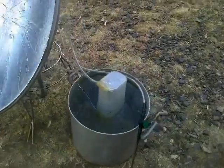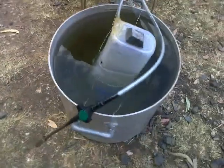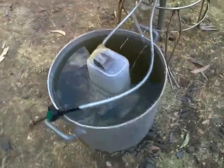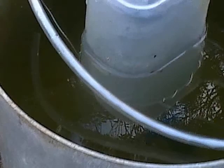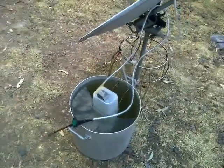I've been running this thing pretty much all day. As far as I can see, I've got 1.75 litres of gas in the gasometer at the moment. But if I add this chunk of a quarter of a pound of lead — and I'm really careful — perfectly centred, there it seems to be there. So instead of 0.1 of a pound per square inch, we actually have something like 0.25 of a pound per square inch in the gasometer.